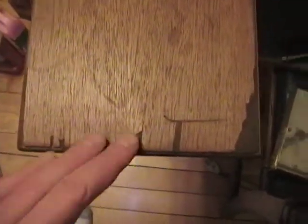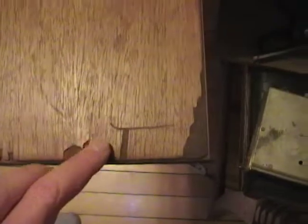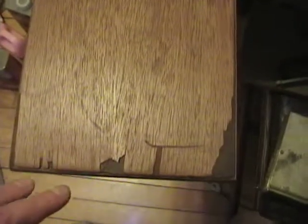Here's the center board I've taken out and already glued down and stripped down. I just need to repair the edge here. What I'm going to do is take some old veneer from other damaged items and try to patch it in, or use new stuff, whichever matches the grain best, so it doesn't look too obvious. Then I'll be using some toner lacquer — a lighter color like a golden oak or light walnut to give it some contrast to the dark walnut I'm going to use on the main body.